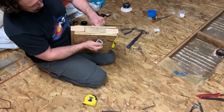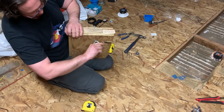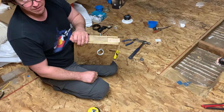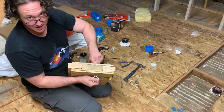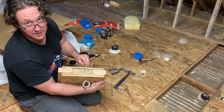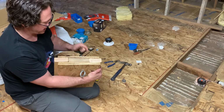But you can see here, since it's not one of the screw-in versions, even if this isn't tightened all the way down where this won't move, if this rotates, the bolts aren't going to come out and you won't accidentally unscrew the hook and fall to your doom. Doom. Because, and that's the other reason why we use a spinner, right? Because when you're using the spinner, then it makes it so you're not unscrewing anything. That's right. But even if we didn't, it wouldn't, because you have two bolts on top. Correct. Okay. But we'll tighten this down enough that it won't move.